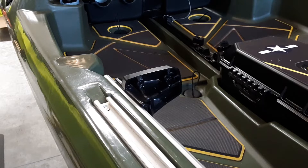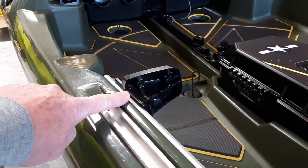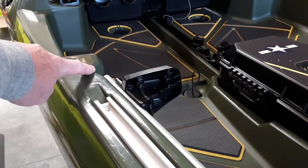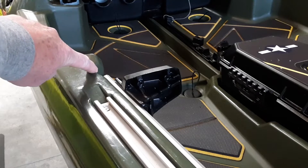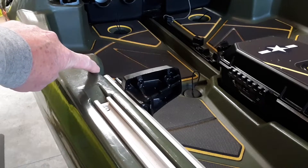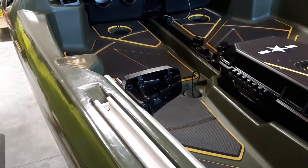This is a view from the front of the boat looking to the rear, behind one of the foot pedals used in this project. Here's the foot pedal and the entry/exit hole for the tubing — the cable steering is going to come out right here, so I'll mark and drill a hole here. There's also a small hole through the pedal itself where I'll tie off the Dyneema cord.